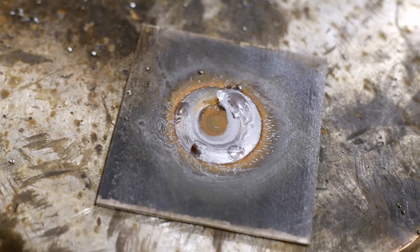Next myth: loose chalk. The internet says to use it, so we're finding out if the internet is right. I noticed the gas nozzle blows a lot of the powder away during welding. Results: quite a few BBs stuck — not any better than the control. Don't use loose chalk as anti-spatter.